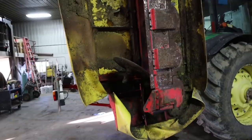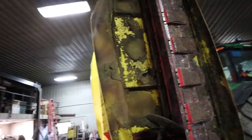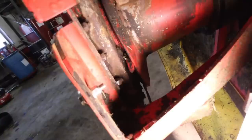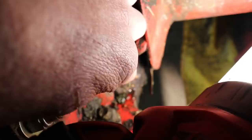It's fairly common for these rotary mowers to develop stress cracks and the cutter head leaks all the oil out. The only attaching point to the actual cutter head is a bracket on the left side, same thing on the right — it's all just its own unit with no center support. Jason had to do the same welding on the right side of the left wing. That's all patched up — it ought to hold oil for the first cutting.